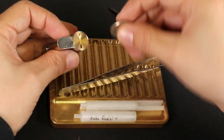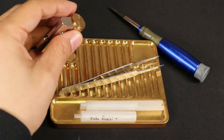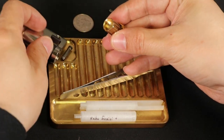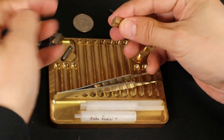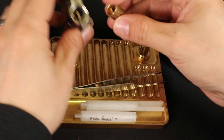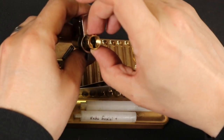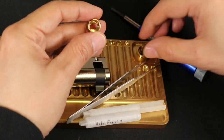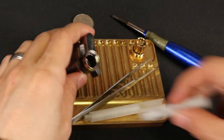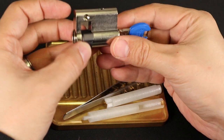Out the back there's a coin slot, so unscrew that with a coin. Unscrew that all the way — there are a couple pieces that fall out. You'll have the cap, then this piece which is the same shape as the back of the plug so it goes in there, and then you've got this piece which interacts with the actuator. That piece marries the back of the plug to this piece that marries to the actuator. It has directionality — one side is thinner than the fat side, so you've got to put it in the right way around.